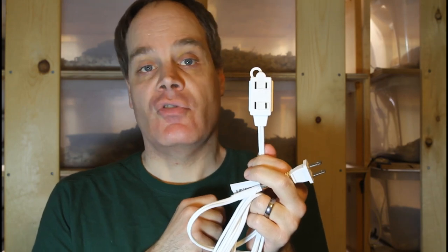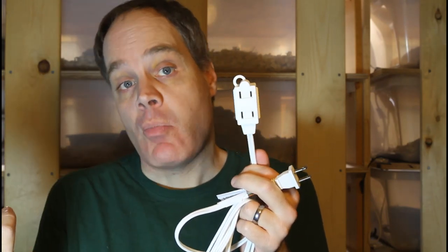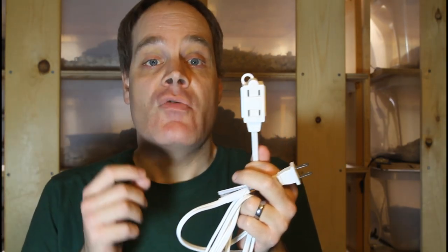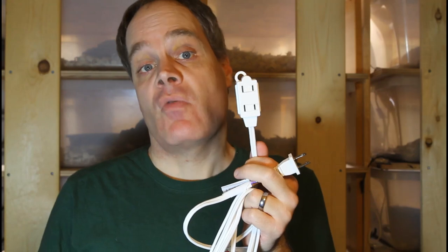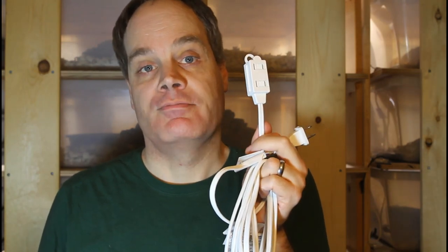And I've used this system to control heat tapes on three separate shelves of a rack, and it works pretty good, and I'm able to get it to within a few degrees. You know, sometimes there's a variability of a couple degrees in either way, but given my setup, it works acceptably well. If you want to control a precise temperature, I would recommend just using one thermostat probe for each heating device and not to split them in this way.